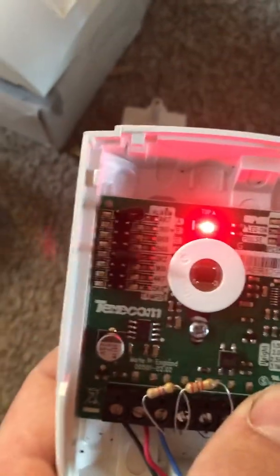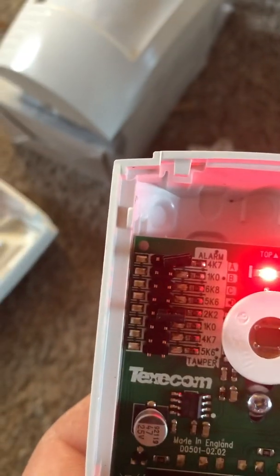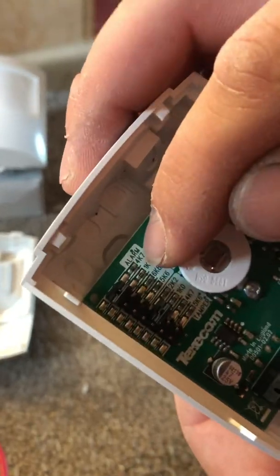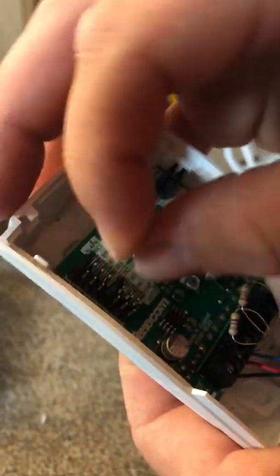On some sensors like this one, you can see they've got built-in resistors at the top, which saves you having to add these separately. You literally just pull the pin out and put them across — it's done like this. There you've got your 4k7 and your 2k2.